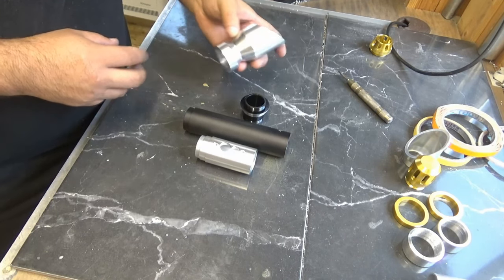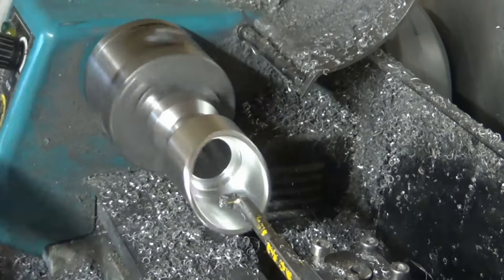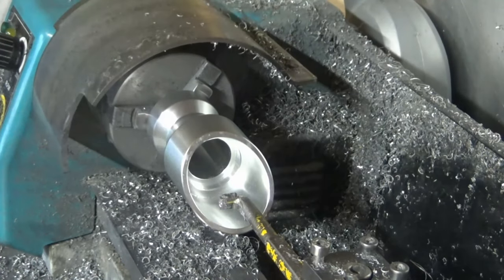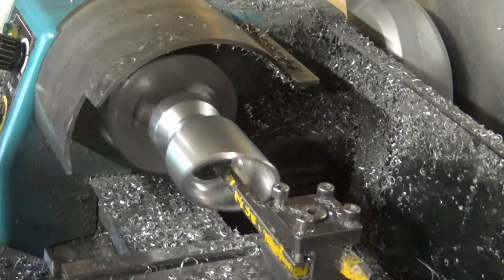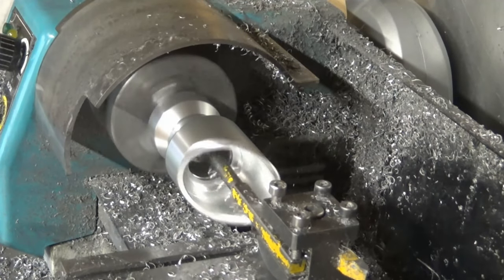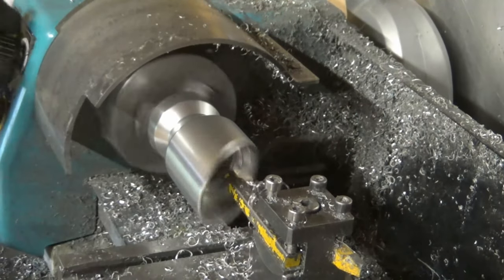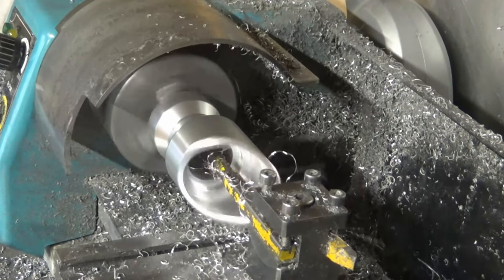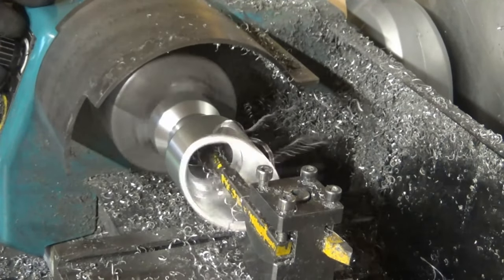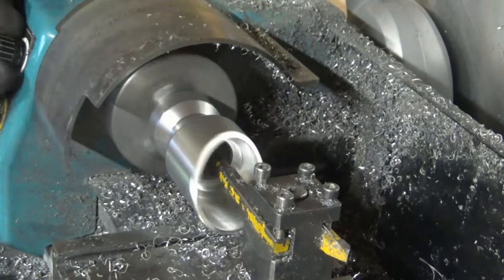The first thing I'm going to have to do is completely change the emitter — it's not good, it's huge. I move over to the lathe and what you're going to see me do now is bore out a large section where the blade will go. The emitter has been set for a one-inch blade but the emitter section is very small — about an inch and a bit. I really wanted to increase the length of the emitter housing so it could hold the blade better.